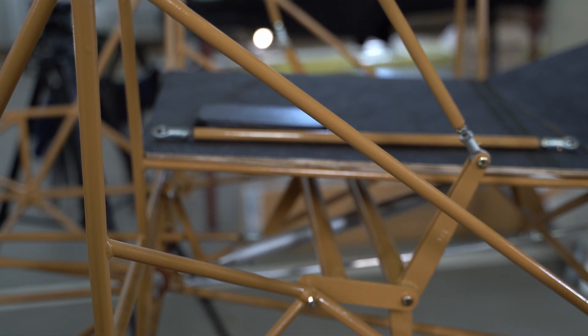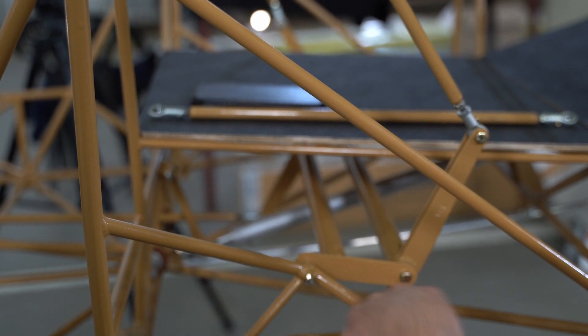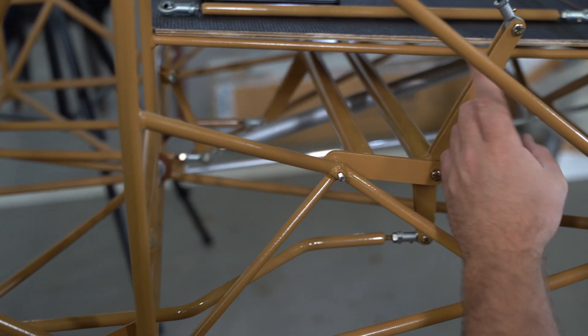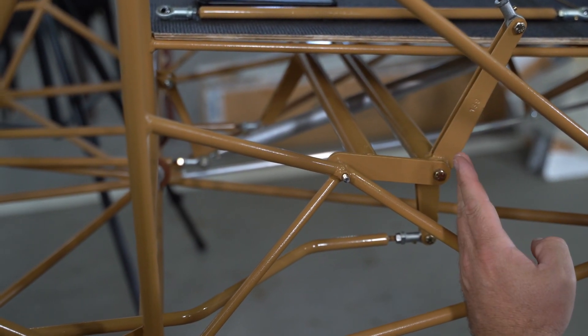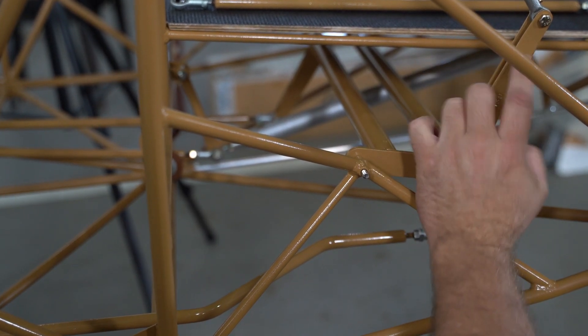Then your next step: hang a plumb line from the center of this bolt down to get the center of this hole. This will give you a symmetrical line around the hinge front and back for the horns.